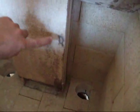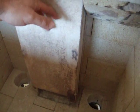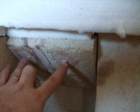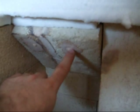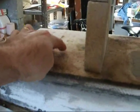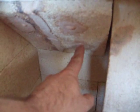This is the chimney box section I made, and it's also coated with ITC — gives it a nice hard crusty surface. Here are the deflectors. These patches of cement here each have a piece of wire recessed about half an inch in, going straight up through the lid, and the wire is bent over and crushed down into this board. So there are two pieces of wire supporting this brick to the roof so it doesn't move around. This is also pinned from here straight into the brick behind it — I did that when I cemented them, as shown in a previous video — so it's pinned from the bottom and wired from the top, meaning this brick should theoretically never fall.